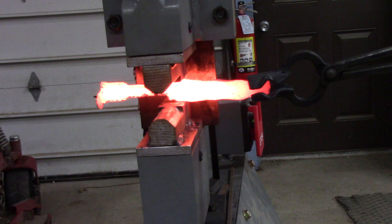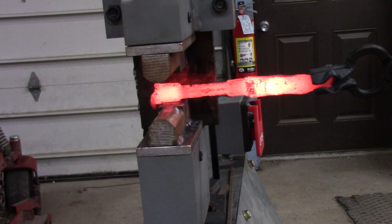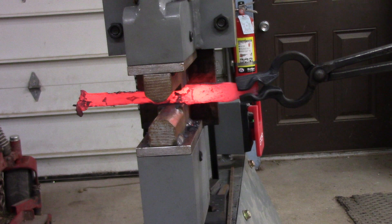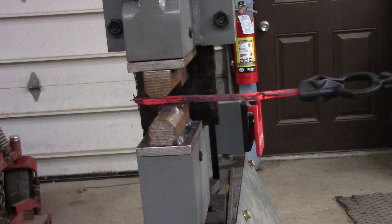When it's up on edge and you give it a bit of a squish, that's when you can really tell if you're managing to get stuff to stick together, because if it's going to come apart it usually does right then and there. I've got a few pieces on the edge that aren't welding in very well, but everything else seems to be welding up pretty tight. You can see the bar is cooling in a fairly even tone — not a bunch of lines, which would show springs that weren't welded together.